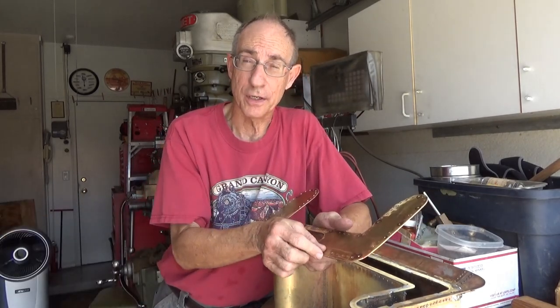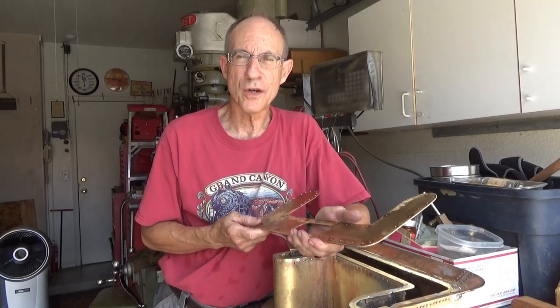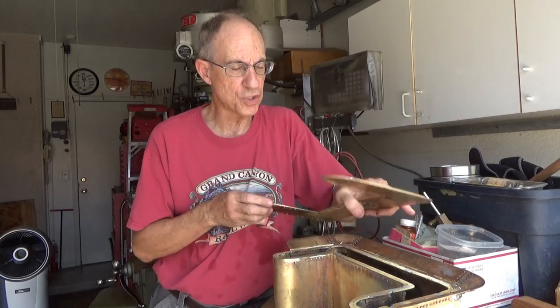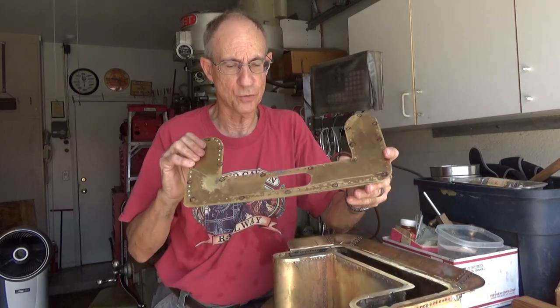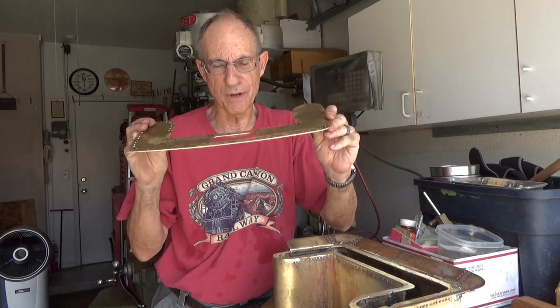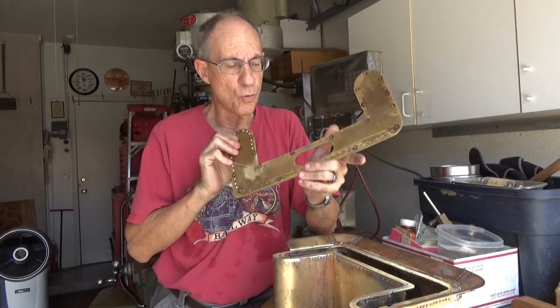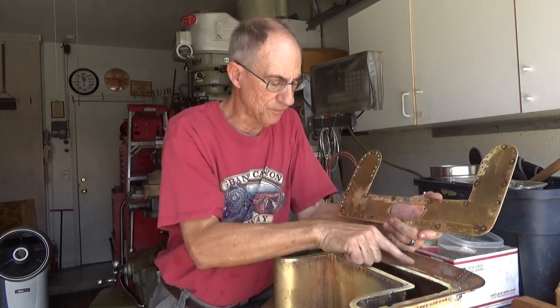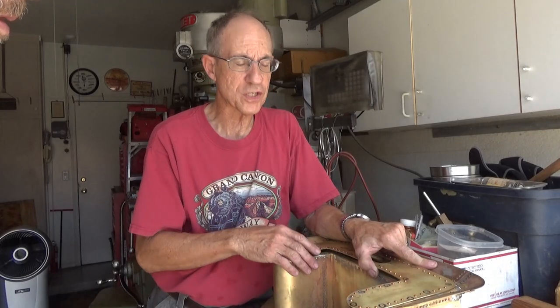Why do you want it flush? Because I'm going to put a gasket on here. One of the beauties of metalworking is that it isn't watertight in most instances. You can appreciate this is a handcrafted device formed of brass, and those things are susceptible to warpage, as you can see by the riveting function here — it's already disturbing the flatness of this plate. With a gasket running on top of this flange, we are able to seal it watertight. You don't want water sloshing out of this because there's an actual wooden plywood deck below this on this locomotive.